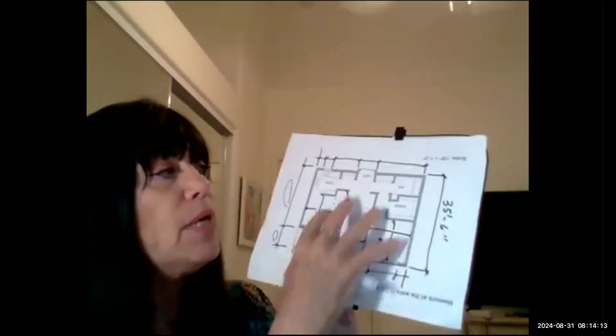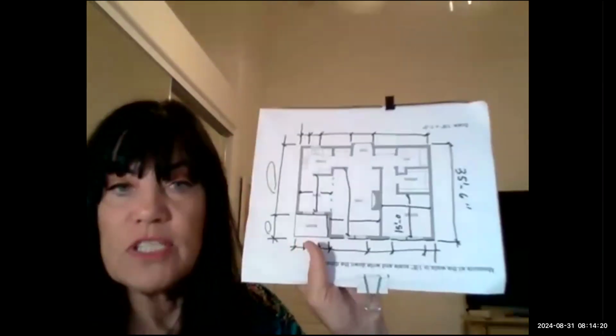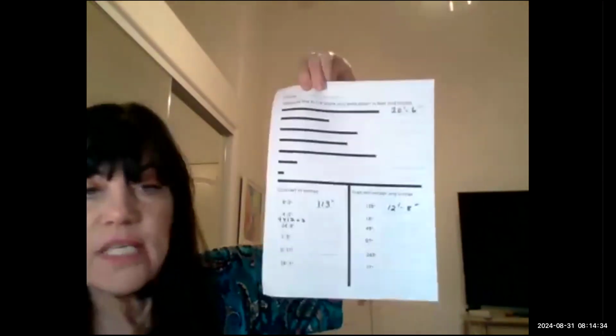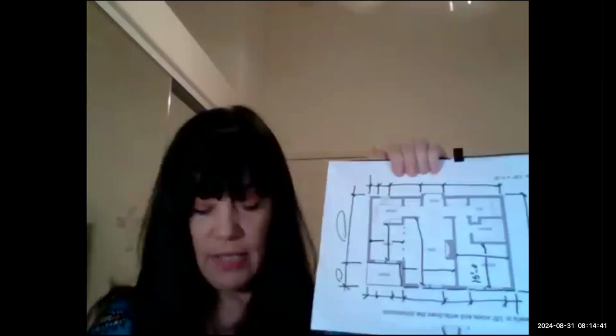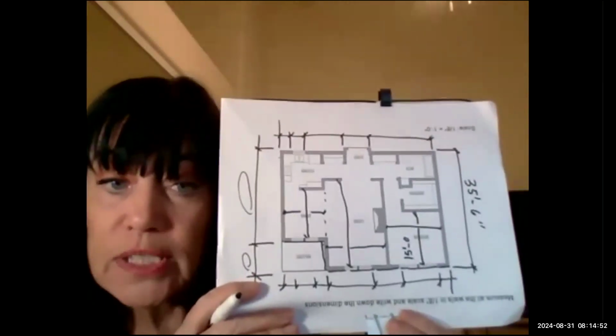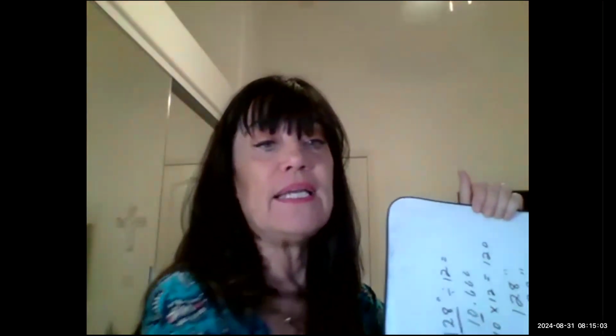So take a look at yours that you print and see if you get 15 as well. Maybe it's not printing to scale, but do your best. Even if it doesn't, I want you to practice. So practice every single area that I've just discussed and measure this whole room out. This will give you a lot of practice. Okay. So between measuring these out in 1/4 inch and placing them in feet and inches, then converting feet and inches to inches and inches to feet and inches, and then practicing with your little handy dandy scale. So you'll go ahead and scan these all in as well with your actual assignments to show that you participated. We'll go through any questions next week if you do have any issues at all on these 2 worksheets. They're great practice, and I think they'll make you feel confident about utilizing a scale.